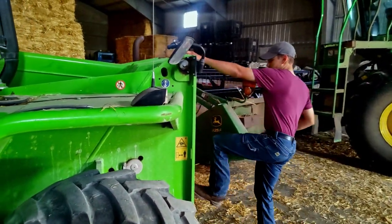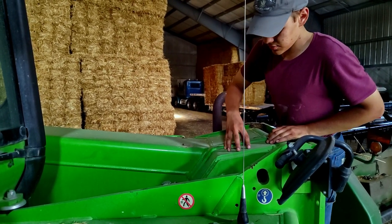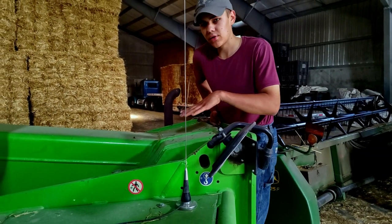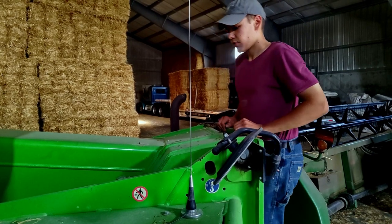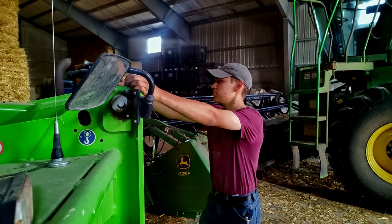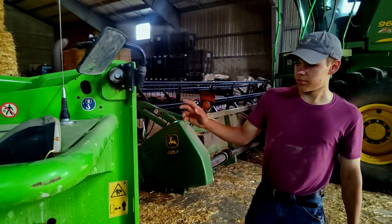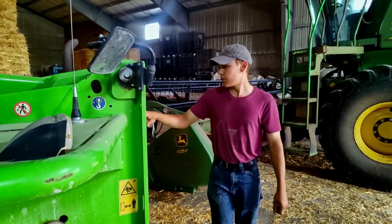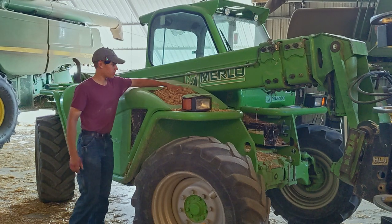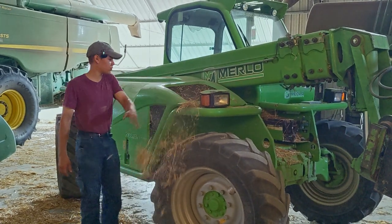It's kind of interesting how the boom works. They've got one cylinder going forward like you'd usually see, but then there's another cylinder right here going straight up and down — I guess that's something to do with leverage to get better force at certain boom positions. The frame build quality is really good — they've got two beefy pieces of plate steel running the length, a plate in the back to cap it off and some gussets underneath. If you take this cover off, all your hydraulic lines to the boom are behind there. Your radiator and screens up front kind of like to get covered with straw, but we've never had overheating issues with these.